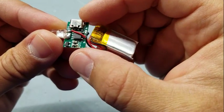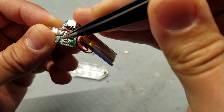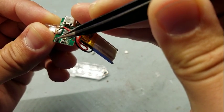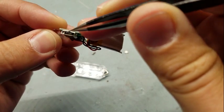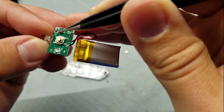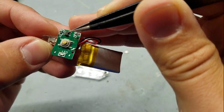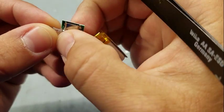On the board here there is the microcontroller, a MOSFET or transistor to run the LED, a USB port for charge input, the LTC 4054 LiPo charger, a charge indicator LED, and of course the switch.